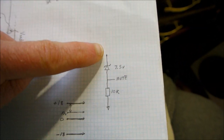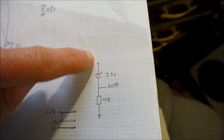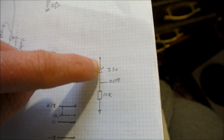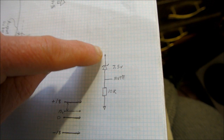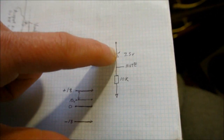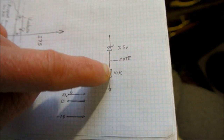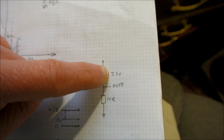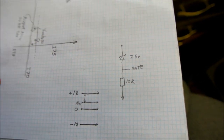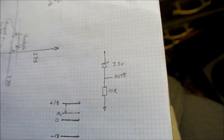I have come up with one solution — use a Zener diode. With high enough supply rails, this will always be at least six volts above the threshold. With a Zener diode and a dropping resistor on the other end to keep current flowing, the Zener will keep the mute pin fixed at 7.5 volts. As long as your power supply rails are stiff enough, this will keep the amplifier running without any problems.